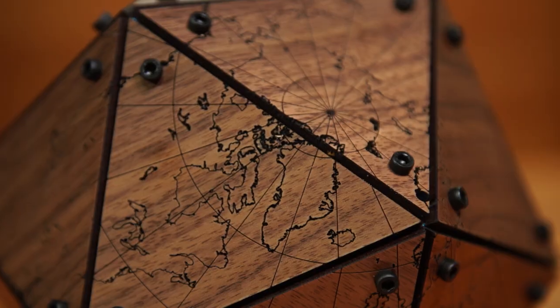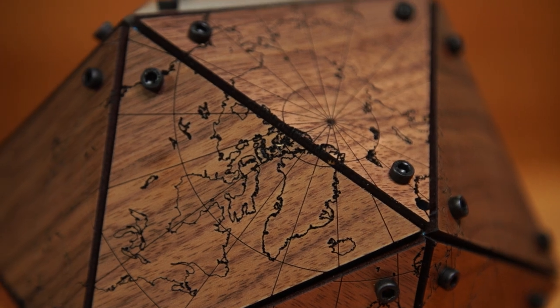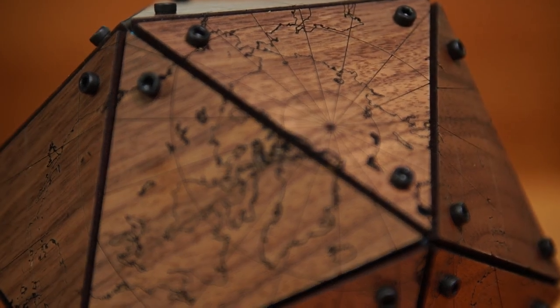Now, in the case of these, thickness doesn't matter too much, because it's all laser cut. So literally, I'd be going in and just enlarging it by 200%. And it should make no difference to the laser cutter, as long as we're using the same thickness of material, or we tell it what thickness. Right, and so we would double the size of the laser cut pieces. They would be 4 times the area, and the holes would be twice as big.